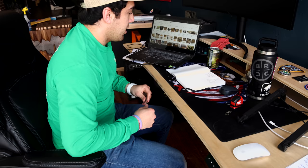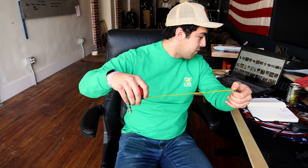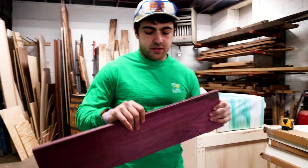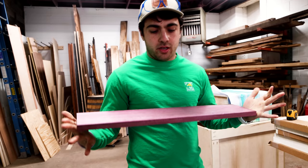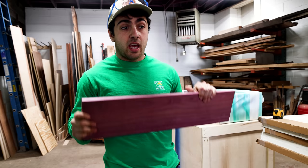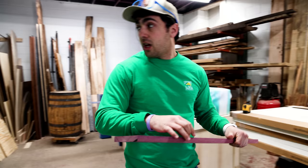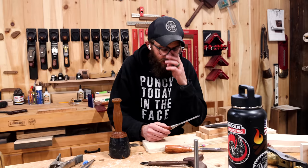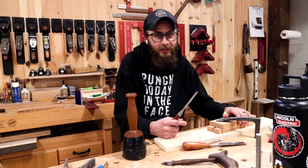John says make a tooltote, but he doesn't say what kind of tools would be toted in it. I'm going to make it carry my tools for the weekend — something about 12 inches long, five and a half wide, come up four inches, with a triangular piece that's 12 inches. Full tote, let's go. Meanwhile Jordan's going with an inlay dovetail using purple heart with an eighth-inch inlay, then walnut. He's got to make twice the amount of dovetails for that design. I can dial in my dovetails while I'm still thinking through the design — probably should sketch something out on paper, but I'm not going to have a plan. I'll figure it out. Let's get them down to thickness.